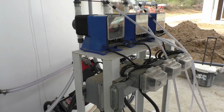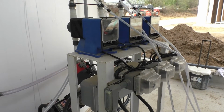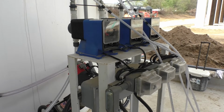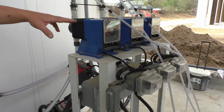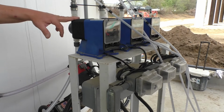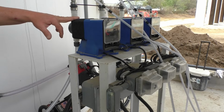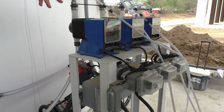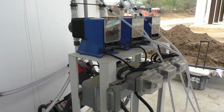So flush them before you start. Don't just come out and flip them on, or do it from in there. Flush them one time really good, then turn the pump on. And I recommend that you run it at the high speed to start with, to get it primed up, let it get going, then you back it down to what you want. Because if you started it on a really low tick, tick, it would take half an hour to get out there.